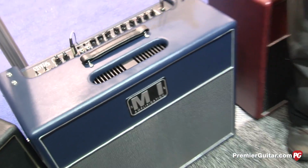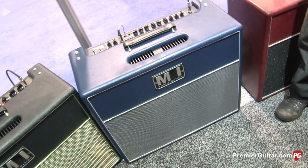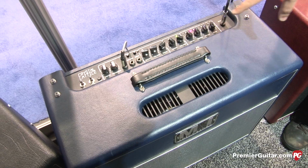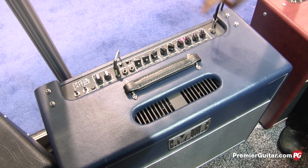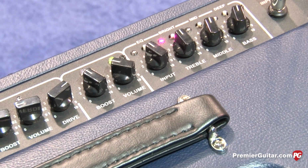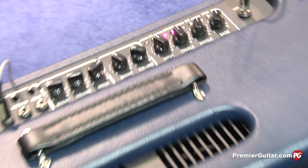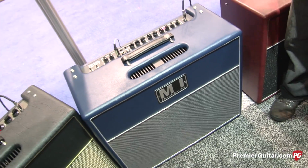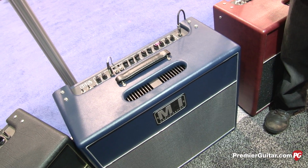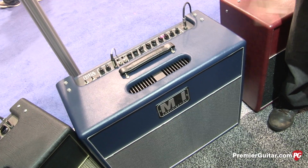We've got the Crystal Lattice, which is a Californian amp. And look up the references on YouTube to understand what Crystal Lattice means. Bit of a silly joke on my part. So one of the interesting things with this is it's got programmable switches for the 4 different modes. One of the standard issues that you have with this style of amplifier is that the way that you set the switches depends on whether or not you're putting an emphasis on the clean sounds or the overdrive. But this way, by making them programmable, you can actually get the right sound for each mode individually, and then you've got individual level controls for each of the modes.